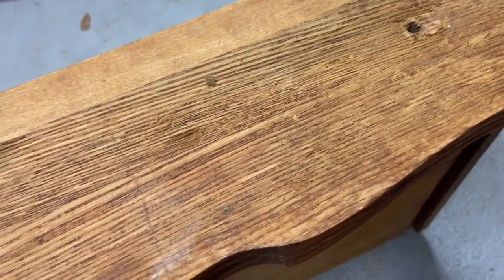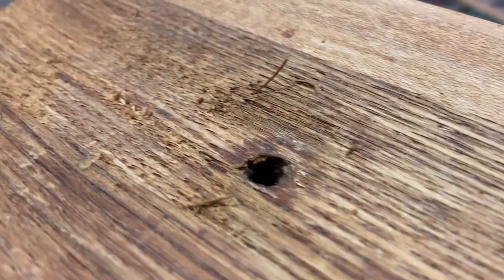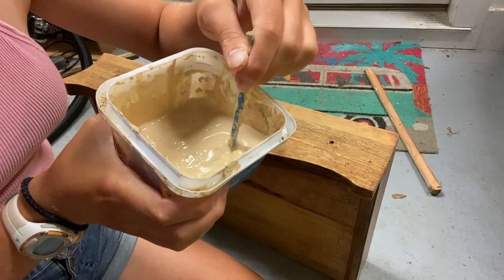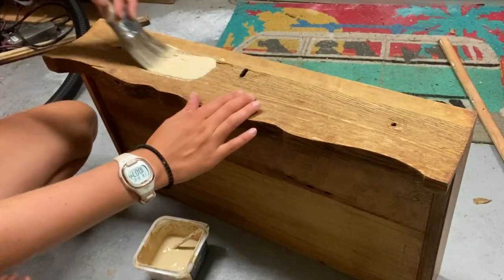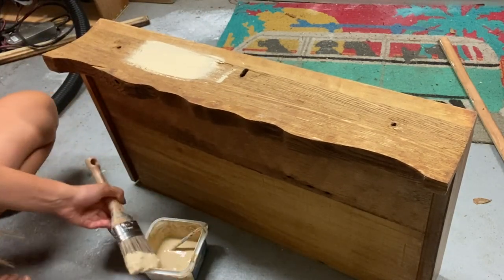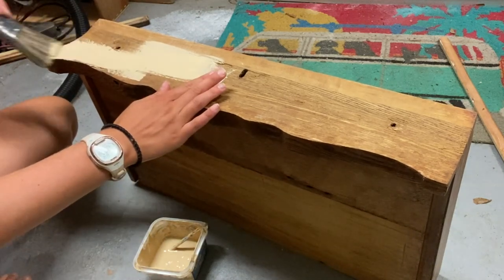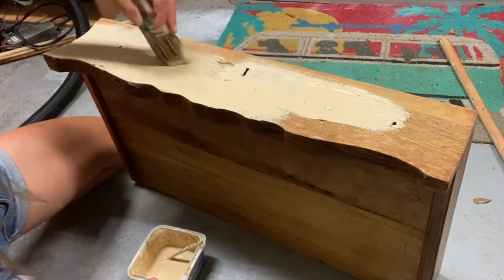After removing the veneer, the front of the drawer was very textured. The wood was very dinged up and the wood grain was really deep. I didn't really want that look, so I mixed some old hardening wood filler with water to create a really thin consistency that I then painted with a brush onto the entire drawer front. Once it was dry, I used my Surf Prep sander again to sand back all of the wood filler.